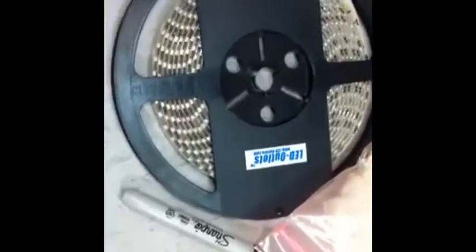We got our LED strip lighting — this is how it comes, it comes in a roll, about 16 feet. It has adhesive on it and you can stick it to the metal, but I'm not going to do that because of the steam and heat from the fish tank. So we're going to put these tabs in — you can get them at Radio Shack. You drill a hole, and these place in, and you can put a tie wrap around them so it actually holds it in. I'm going to put a series of them in this metal strip, then tie wrap the LED lights because we're going to cut them in strips of four.